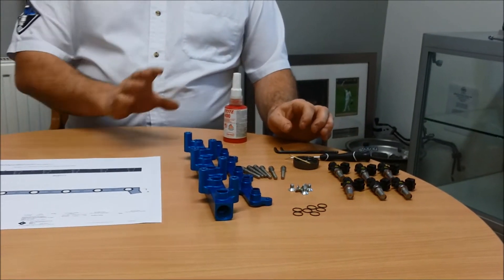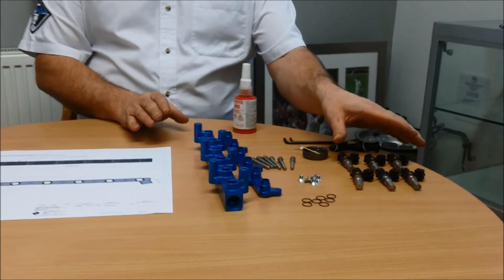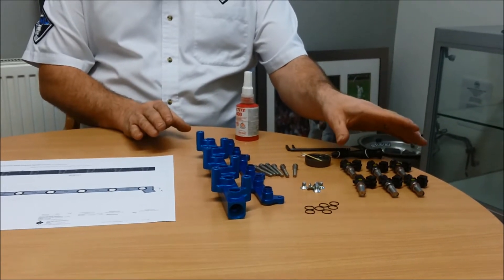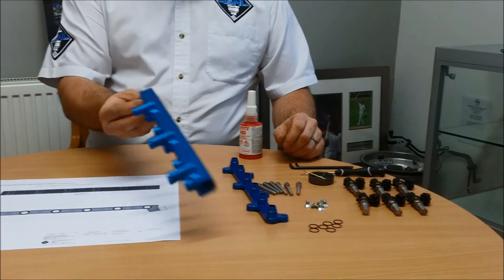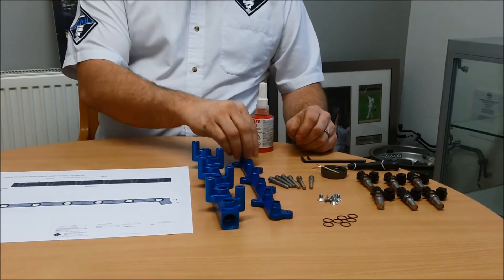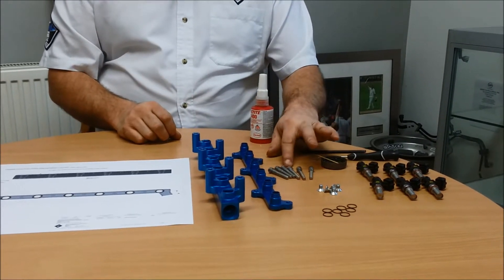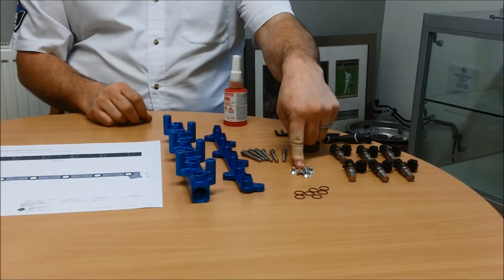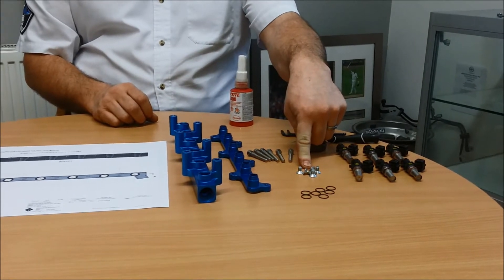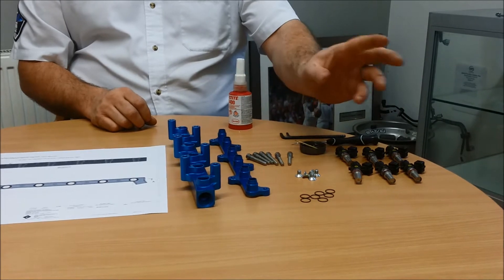You will receive in your kit a set of six injectors of your choice — these are the ASNU SC designed, specifically designed for this installation. You will receive an upper and a lower base plate, which is actually the fuel rail, six mounting bolts, five retaining screws for the lower base plate, and eight o-rings of which two are spares.